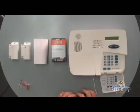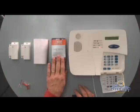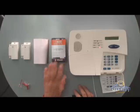Now it's time to mount the motion detector, and a couple of things to keep in mind. The motion detector has a battery saver feature built in which will limit its signaling to once every two and a half minutes. So prior to testing your alarm system after you've mounted it, cover each motion detector in the home with a towel or a hat so that it cannot see any movement within two and a half minutes prior to your test — that will allow for smoother testing. You may also slip the motion detector into the walk test mode, which bypasses the battery saver feature. To do that, just open the cover and close the cover, and that will cause the walk test mode to be activated for a limited number of transmissions. It will also slip back into battery saver mode on its own to extend the battery life. That completes our programming of the K9-85 MCW motion detector.